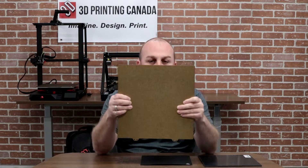The first build plate I have in front of me is a spring steel that's textured and also has a coat of PEI over it, so no need for using glue stick. These work great for PLA mostly. PETG, ABS, and things like that can actually tear chunks of the PEI off, so if you are using PETG, at least use some glue stick as well with this style of spring steel. These work with a magnetic surface and just stick to the bed for easy removal, and you can also flex the plate to pop the print off.